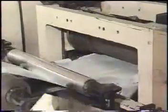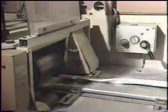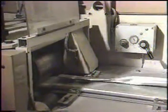The circle knife is used to trim the edges. Its structure is similar to the one used for making the absorbent body. It also comes in a set of 3 sizes for easy maintenance and size adjusting. The trimmed-off waste is collected by the Waste Recycling Collection Fan and sent to the recycling net. It will be packaged and sold to plastic factories for reuse. This ensures better use of the resources and reduces waste at the same time.